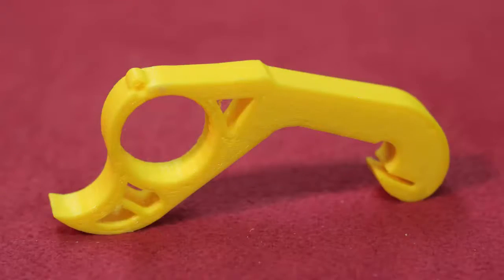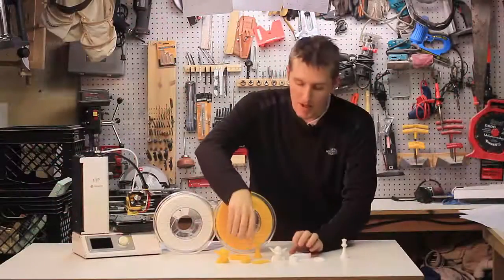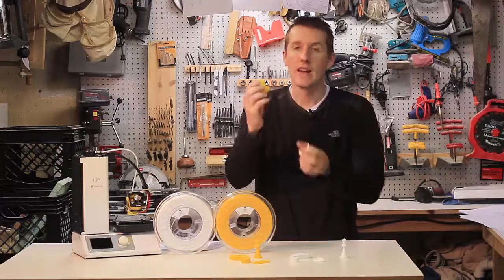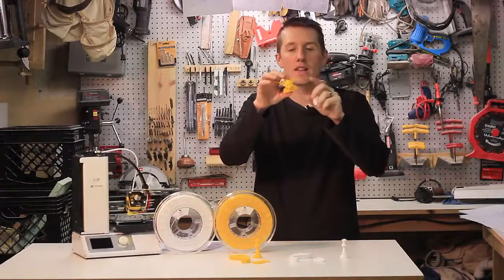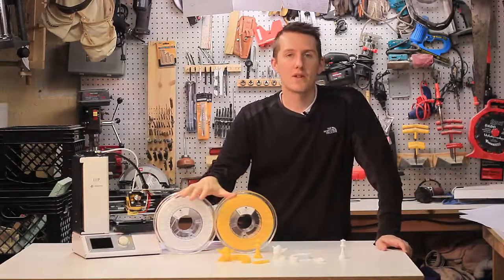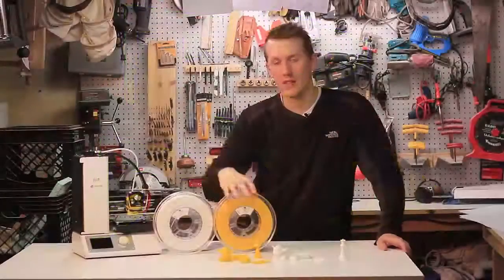No sanding needed — these layers are blended so smoothly, and that's with a 0.3mm Z height. If you print at 0.2 or 0.1, it would look amazing. I'm happy with both the finish and the strength. As for the Yoda head figure, at 0.3mm you don't expect much, but it looks really great and the detail in the face looks great. I did print support on the overhangs, but I don't think it really needed it. Both pieces came out excellent. This is one of the nicest filaments I've printed with — buttery smooth, professional, and shiny.